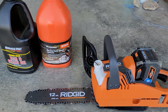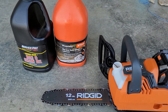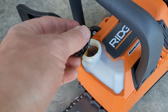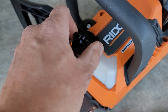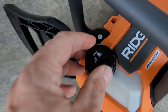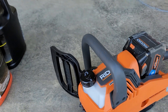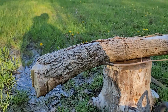Video wouldn't be a video without sending it through a log or two. So whatever bar oil you want, just add bar oil - going to top this off and let's go cut something. It has an o-ring in there, and the bottle is translucent so you can see when it's full. You don't have to really wrench the cap down hard, and in case it gets swollen and you have a hard time getting it off, there's a nifty little slot where you can take your scrench, pop it out, stick it in there, and turn the cap.